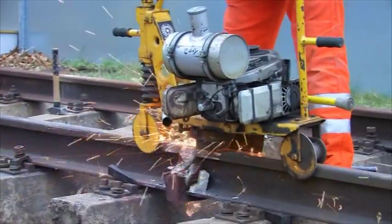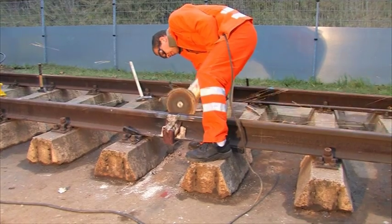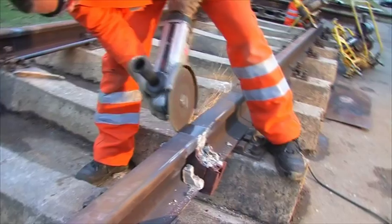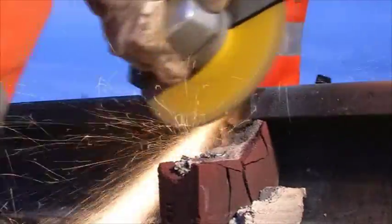The residual welding material on the running surface and on running flank will be ground off. The shrinkage downwards is finished not before the ambient temperature is reached. Therefore, a small oversize has to remain after rough grinding. In case of reassembled and tightened fasteners, the weld could now be passed by a running wheel.